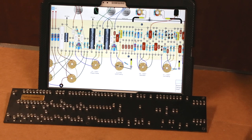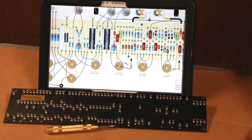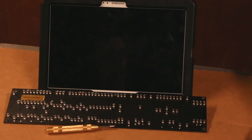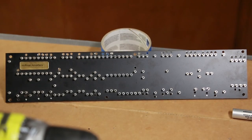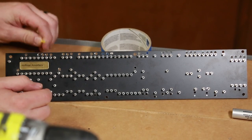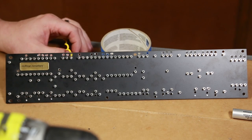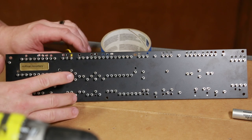I've marked white dots on the board corresponding to where I'll drill the wire feed-through holes — you can see one right in front of my finger and several throughout. I'll drill where those are and then feed the wires up into them. I don't need to show the drilling again, but I'll use a drill bit slightly larger than the wire diameter. All holes are done now — I tested with a piece of wire from a previous power transformer and it goes through nice and evenly.